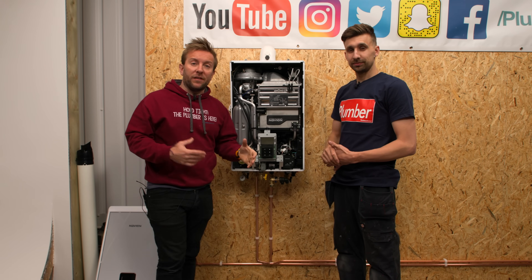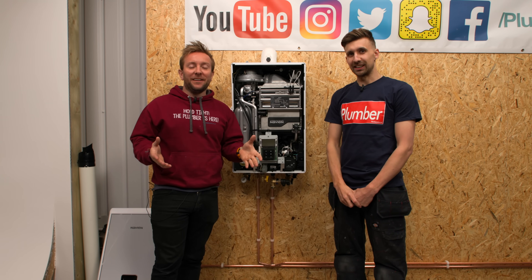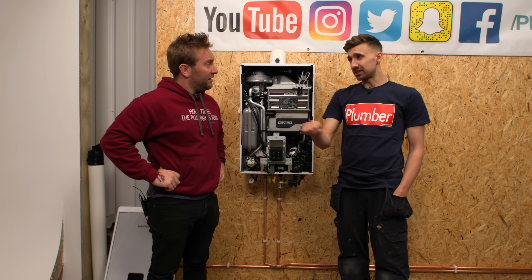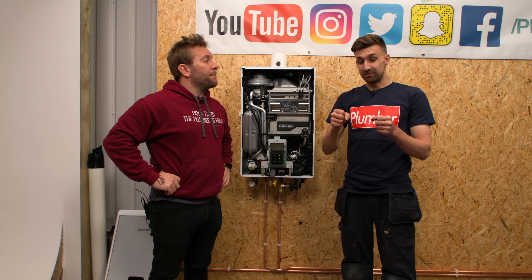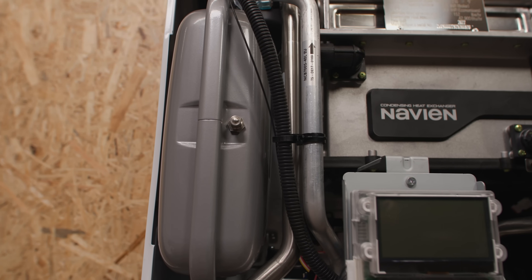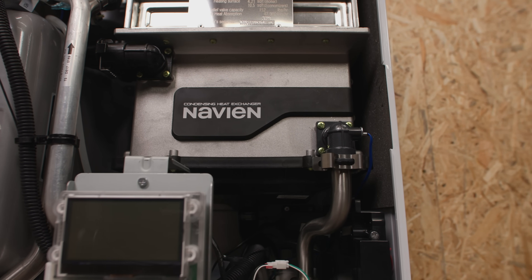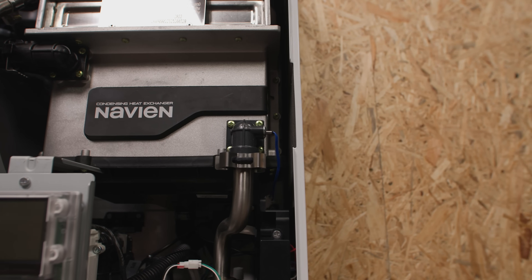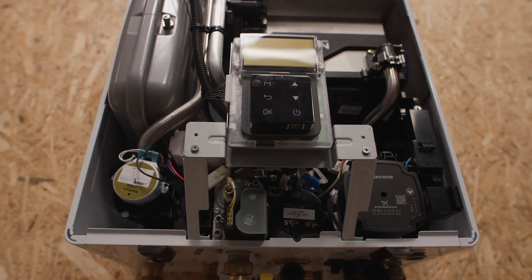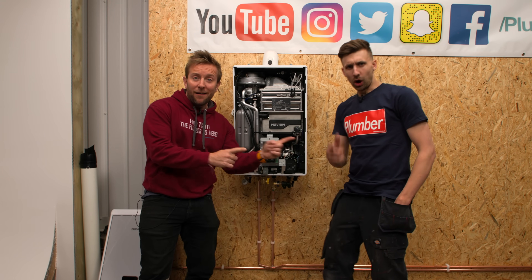So there you go. One thing to remember: if you're going to have one of these boilers, make sure you properly insulate all the pipe work, especially on secondary return — otherwise you'll be losing loads of heat into the floor voids. Also, I've seen people do their secondary return in plastic and it's not barrier pipe, so everything becomes brittle and you get pinholes. I hope you've enjoyed today's video. You now know about this boiler — it does exist. We'll leave all the links below to Navien's website so you can find out more. Hit subscribe and remember to hold tight. See you soon.